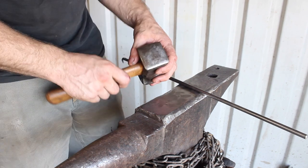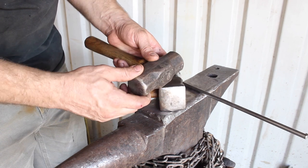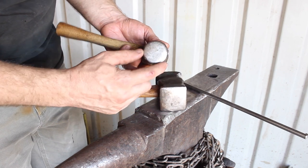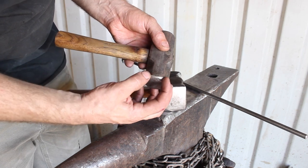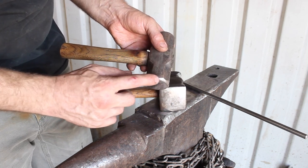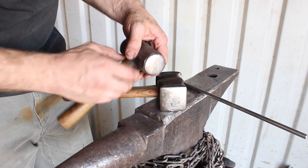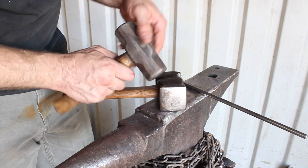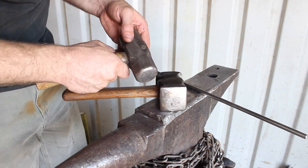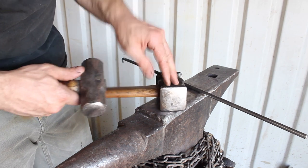On a typical hammer such as this four-pound sledge, it's got a rounded-off face and the only available die edge you have is about five-eighths of an inch wide, which really limits your ability. It's really just for striking something right in the general center of the face. You can still use it for forging, but it's not nearly as versatile.